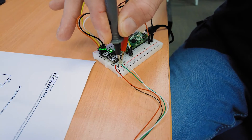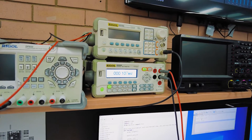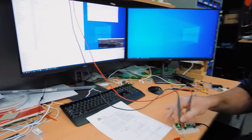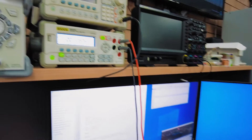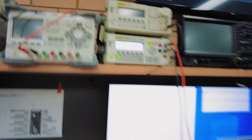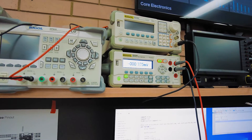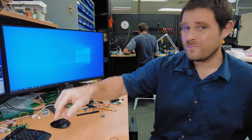So you're measuring across the differential output — effectively the output of the load cell. We're measuring about 0.1 millivolts at the zero point. Applying about a kilogram of force with my calibrated thumb, we're measuring at most about two millivolts of deflection. And when you let that rest, we're back at zero — 0.1 millivolts. So we're only getting about two millivolts, which means load cells clearly need amplifying.